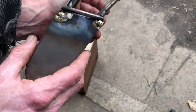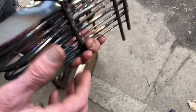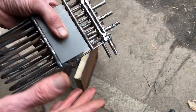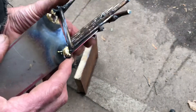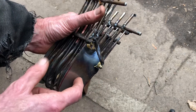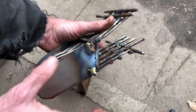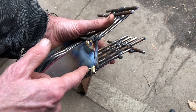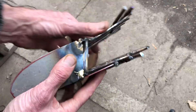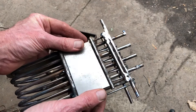I'm experimenting with brazing here. I did a lot of welding — my welds aren't the greatest — and then you have to grind them, and the grinding takes forever. Brazing is actually pretty cool. For example, if I want to remove this, all I have to do is heat it quickly with my oxy magna gas torch. The piece gets so hot and the bronze brazing melts at a relatively low temperature, so you can just take it off and rework things as you experiment.